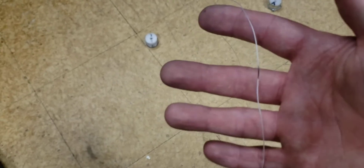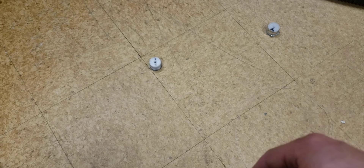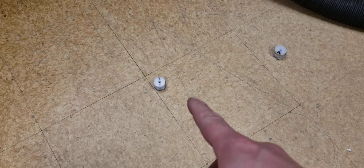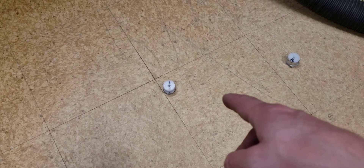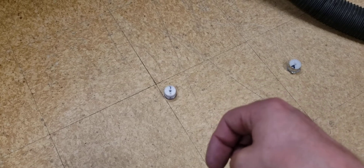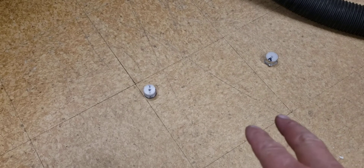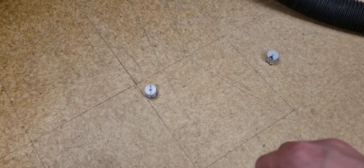There are two 12-foot lengths, and you're going to need to reuse your spools. When you take them off, make sure you label left and right. Unless you're going to recalibrate your steps per millimeter, it's not that big a deal — they're pretty similar — but I just recommend not mixing them up. Keep your right and your left labeled so you know which one's which.